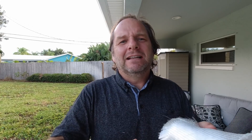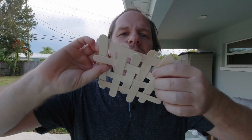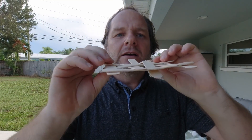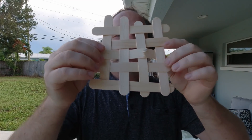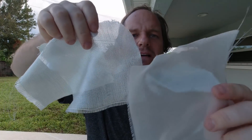In this episode we're going to talk about fiberglass cloth — which one's the best to use and why. The best practice if you're repairing a boat is to find out what the lamination schedule is, or the specific cloth they used and how many layers, and then duplicate that. There are three different types of weaves we're going to talk about. First is woven, probably the earliest and most common — woven like a piece of cloth. Here's a couple of samples. This first one is about one ounce or ounce and a half — very lightweight, good for models and things like that.